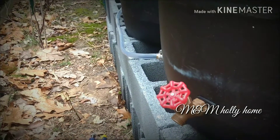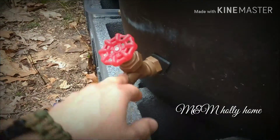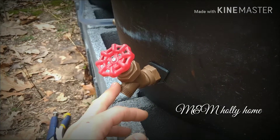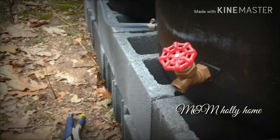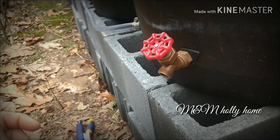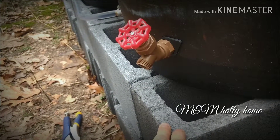When you put your rain barrels in, I recommend giving them a good strong base. You can place them right on the ground and move your spigot to midway of the barrel, but you'll never be able to get the rain water on the low end. I wanted the spigot at the bottom so we can get as much rain water out as possible, but you can only do that if you get them off the ground. Cinder blocks are cheap, so make a good base with cinder blocks — you don't want to use treated lumber because when these things get full they're going to get really heavy.